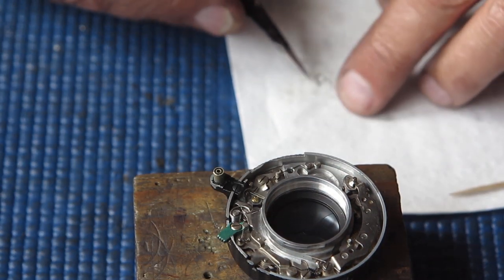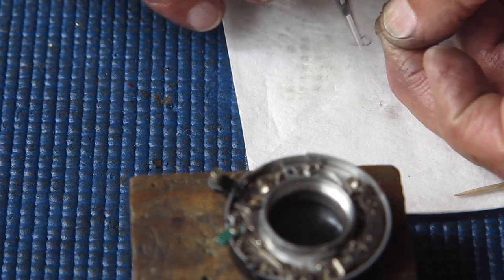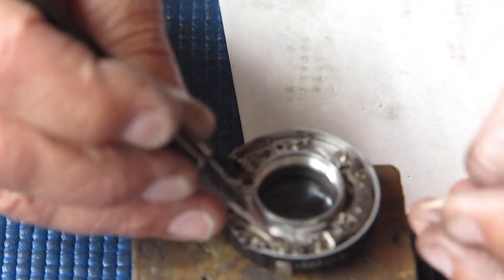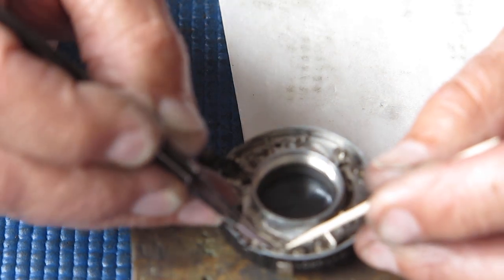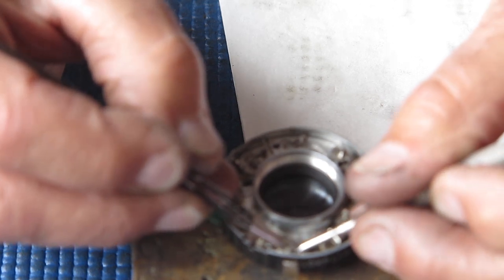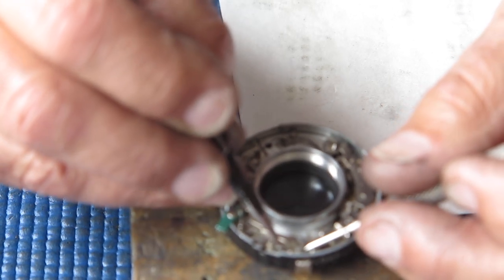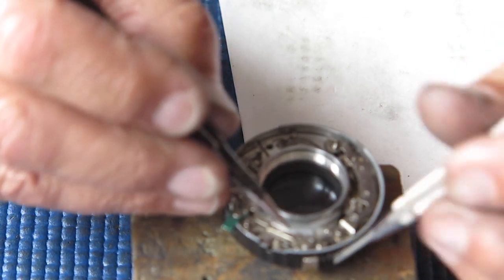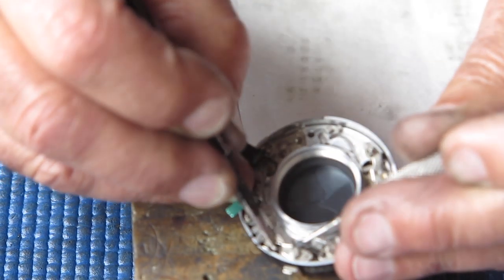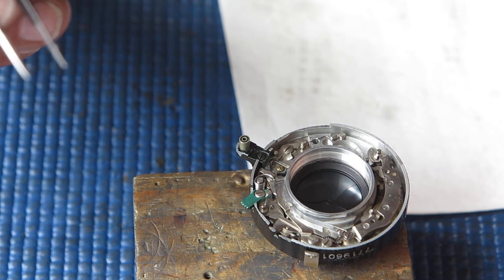It does. Tighten that screw up. Now the spring. The spring fits over that screw. First I'll get it over the screw, then I'll set the ends in position. That's okay. Move that over there out of the way for the moment. I want to get this end of the spring behind the lever at this point. Nope. That just sprung off into space.